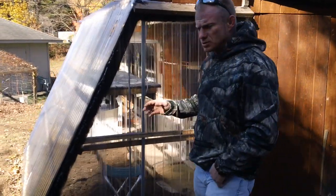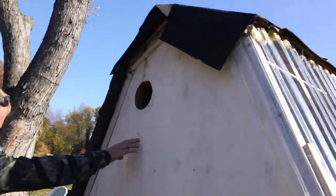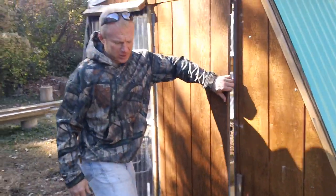Let's walk around the outside of the greenhouse real quick. Last year we had the plastic on it. This year we've got the corrugated polycarbonate, and of course we've extended the greenhouse. We started with just the small half here and doubled up to the large half. We had a rocket stove in it and the flue was out back - we did away with that. That's still our exhaust fan there, controlled by a dimmer switch so we can speed the exhaust. This is the north side, which has got a layer of foam insulation, a layer of plywood, and then corrugated on it. We used some heavy duty roll roofing that we salvaged and just put this plastic corrugated on to shed the water and keep it all good.